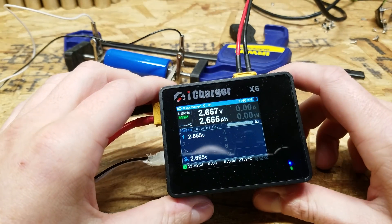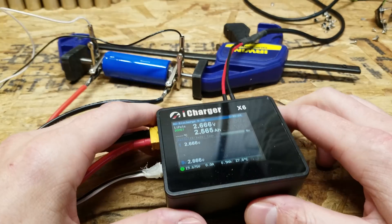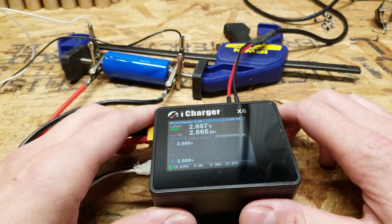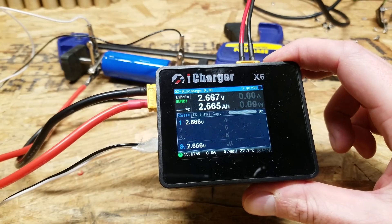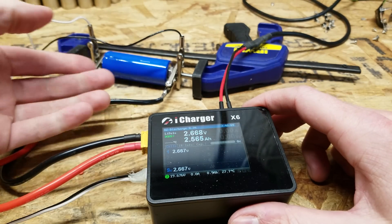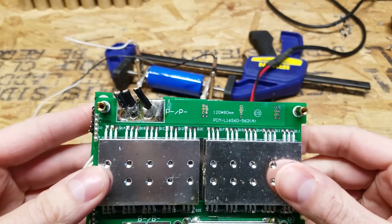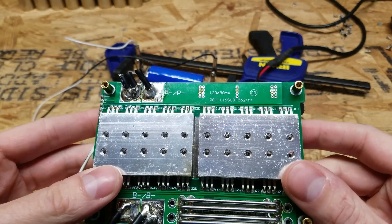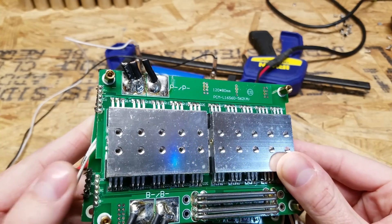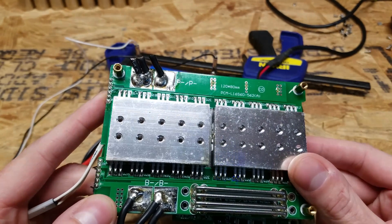So the capacity test finished up, and we came out to 2,565 milliamp hours of capacity in one cell. I do believe these to be 3200 milliamp hour cells, so I was expecting a little more capacity — it was just a little bit lower than I thought, and that is around 80% of the original capacity. I don't know if the other cells would test any better; I only tested one, so it's not a very large sample size. Also, while this test was running, I did find out that this is a 60 amp continuous BMS with a 200 amp surge rating. It was selling for around 50 bucks on eBay, though there was only one seller so I'm not sure how reasonable that price is. I'll leave a link to the specification sheet I found for this BMS in the description if you are curious.